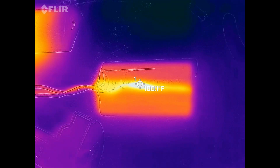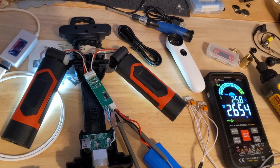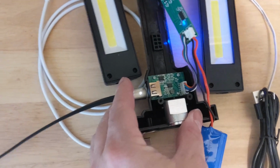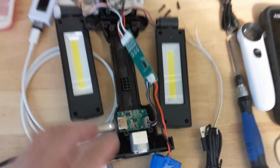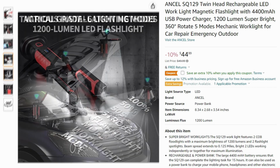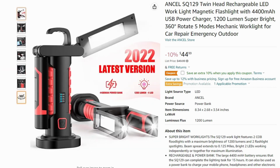And we don't have a really good indicator of when it's actually going to stop working on us. So the 25% LED does flash anytime it gets below like 3.4 volts. It starts going like 25%. The problem with that is you don't get a really good idea of when it's actually going to stop working on you, just watching the light, because the light blinks for quite a while. All those are minor things, I believe, but they are improvements.